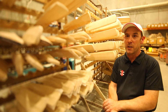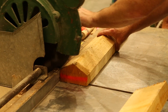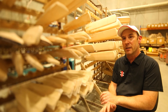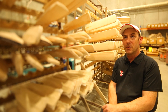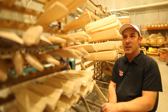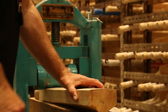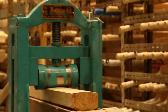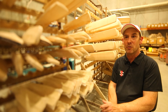What we need to do then is cut the clefts to length. Then we machine them through — we have a four-sided molder that gets it to the legal width and just cleans the face of the blade so we can see what we're finishing up with towards the final product. At that stage, once they're all graded, all the clefts are pressed just to ensure perfect rebound, making sure nothing's over pressed. Every cleft is tested just to make sure that the rebound is right where it needs to be.